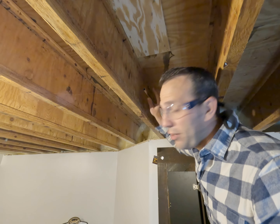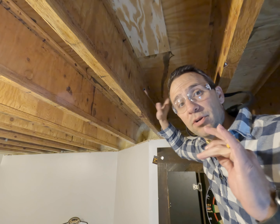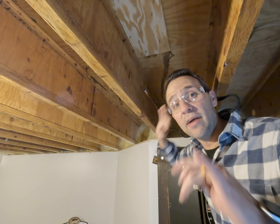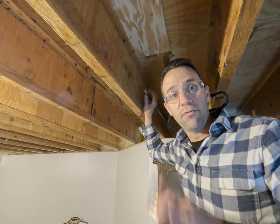The next important thing about soldering is that you don't want any water in this pipe. I know there's no water in here, but if there was, make sure there's no water — drain it out, do whatever you need to do. If there's water in there, your solder will not flow.